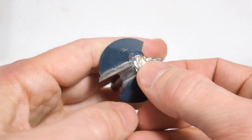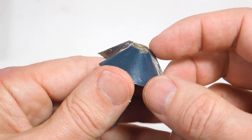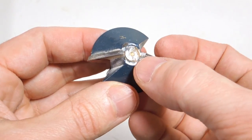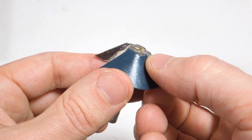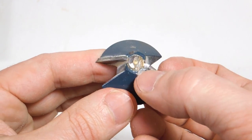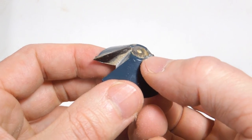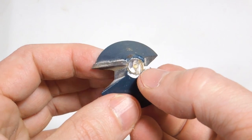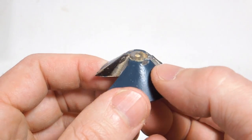I've had a problem with this bevel bit. When I ground off the guide post, I found that the top edge really wasn't the right shape and it caused some burn marks. So I had to actually relief cut the carbide back a little bit. The bench grinder doesn't really work very well with that. I found a diamond tip tile saw was able to cut the carbide, but not very cleanly — it made a bit of a mess of it. But it was good enough to make a relief cut, and now this bit doesn't burn anymore.